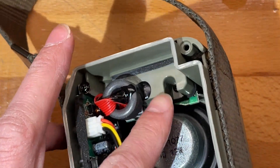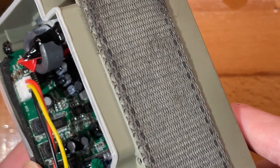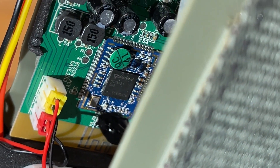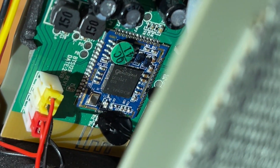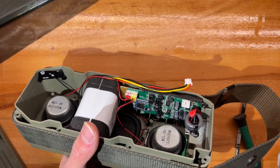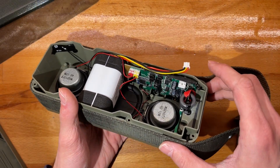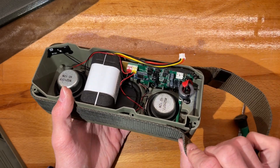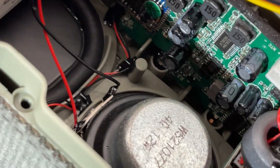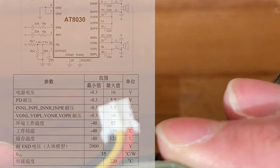It even has a date on the battery from a manufacturer called New Energy Science and Technology. It has a separate compartment for the power section. The Bluetooth chip is a Qualcomm QCC3021 — a newer chip from what used to be CSR. A lot of manufacturers including JBL are now using cheaper Bluetooth chips that have reached feature parity with CSR at a lower price. The amplifier appears to be the AT8030.